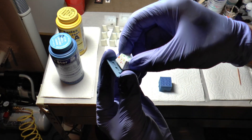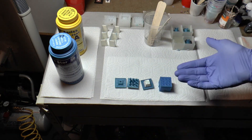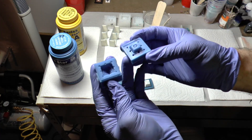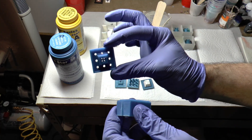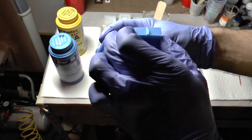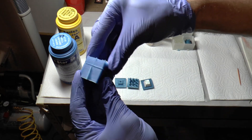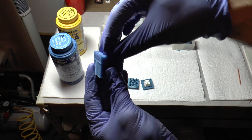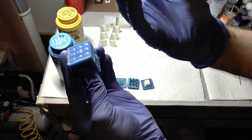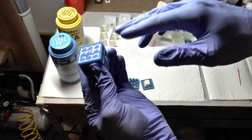There's a little connector so you just click that right in, and then when you're pouring your silicone over the top you'll be able to make the mold. For those not familiar with the two-part mold system: you have holes in there, and this goes on top just like a cap. It's keyed in — there's a round part that lines up — and you want to make sure it's nice and tight. All these are compatible and keyed in nicely so there's no wiggle or play, it's not going to create a vacuum effect, and all the little imperfections come out into those sprues. You snip those out and then you have your cap.